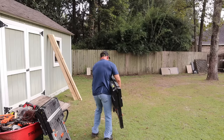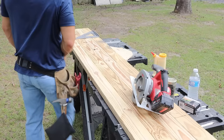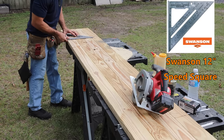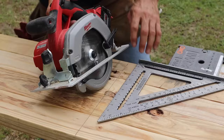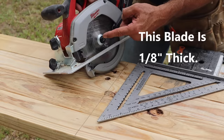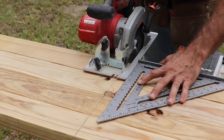I like to make sure they're all in line, so after making a mark on each one I line the boards up at the back end and use one big square to mark them all off. I put my blade right on the outside edge, not the inside, because this is an eighth-of-an-inch blade — that carbide tip will take an eighth of an inch off and you'll come up short.